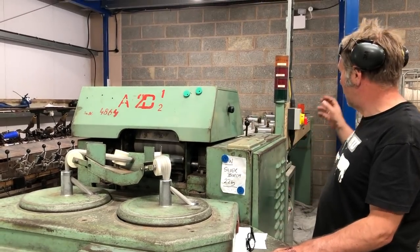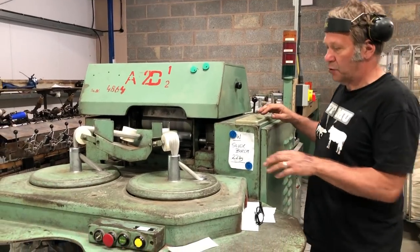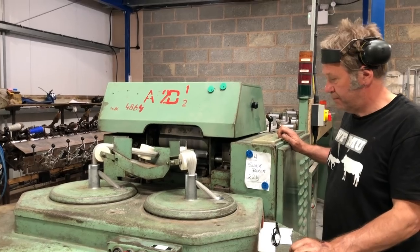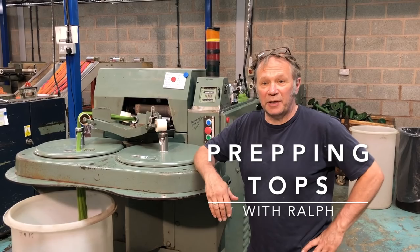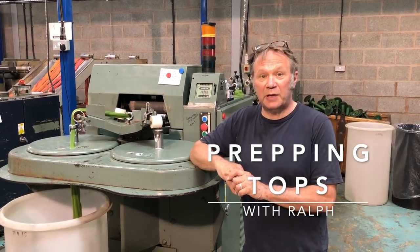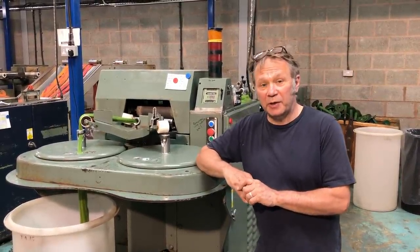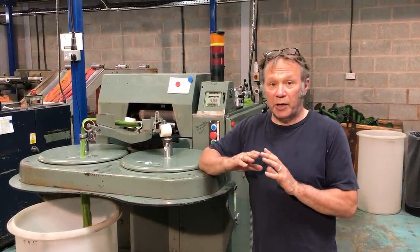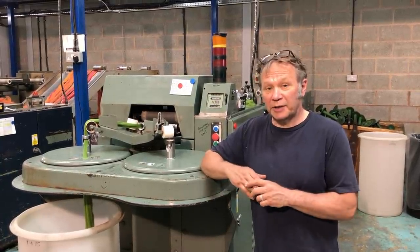So we are just knocking down. That's all we're using the gill box for. It's drafted down to weight, ready so it can be fed into the sliver spinner. So there are two directions to go in spinning, as we mentioned earlier. The first one, which you've seen, is to spin using our sliver spinner, which we call Kevin. The other way is to spin using our machine which we call Butler, which is also a ring spinner, but it's supplied by rovings as opposed to being supplied by sliver, or in our case, tops.